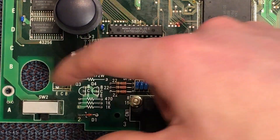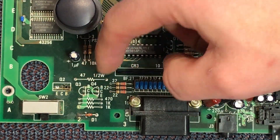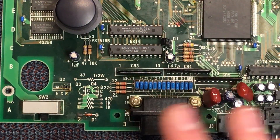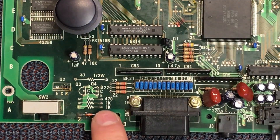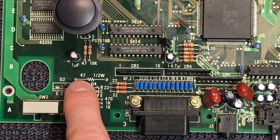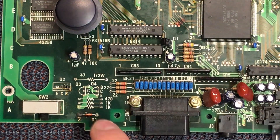The circuit consists of a big power transistor - a Darlington transistor - two smaller ones, and some resistors. They're completely missing, so I know for a fact this is not going to work. We'll go through the steps on getting the parts, soldering it all back in and testing it out. The parts are actually printed on the board: 47 ohms half watt resistor, a 470 ohm resistor probably at quarter watt, and two 1K resistors probably at quarter watt.